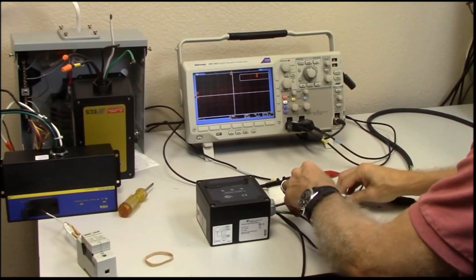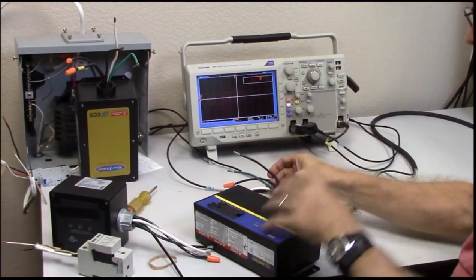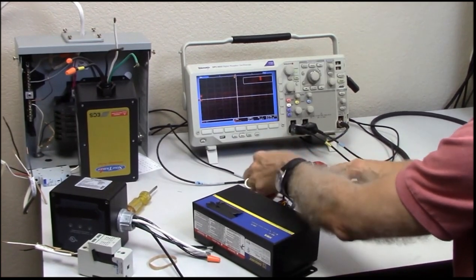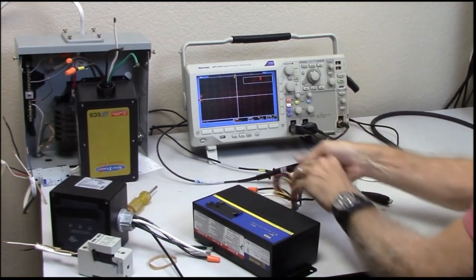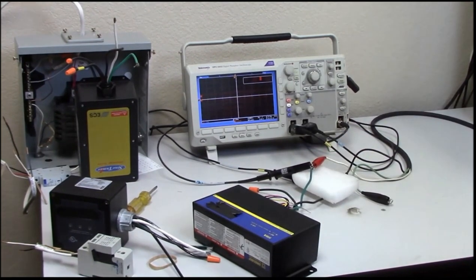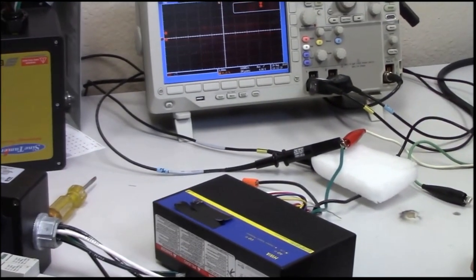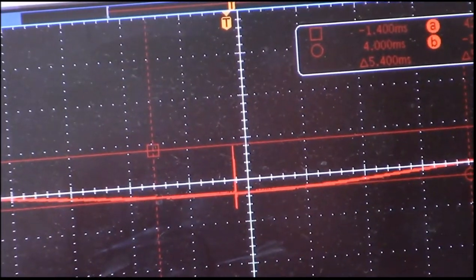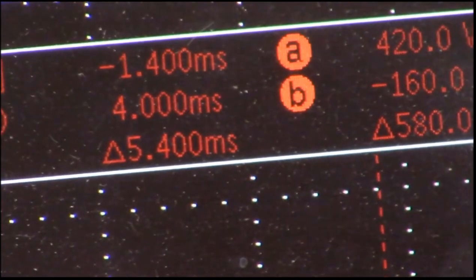Let's clear that and remove this unit. This next unit is quite popular. It can be mounted internally into a panel itself or externally. This unit actually has an audible alarm that will signal when there are problems within the unit or when the dry relay contacts are not connected. We're going to test this one line to ground as opposed to line to neutral. Apply power — LED is on. Charge up the generator. This one is almost identical to the previous one: about 580 volts, a very similar type of technology with respect to attempting to clamp the ring wave transients.